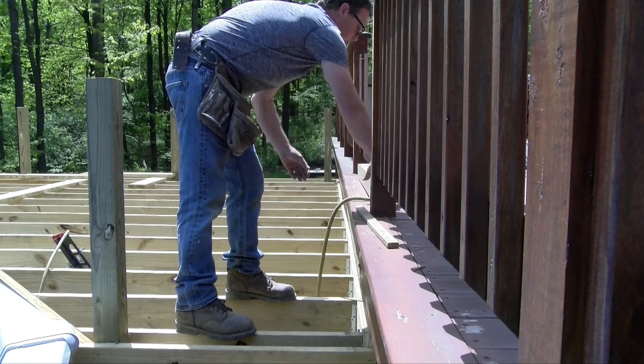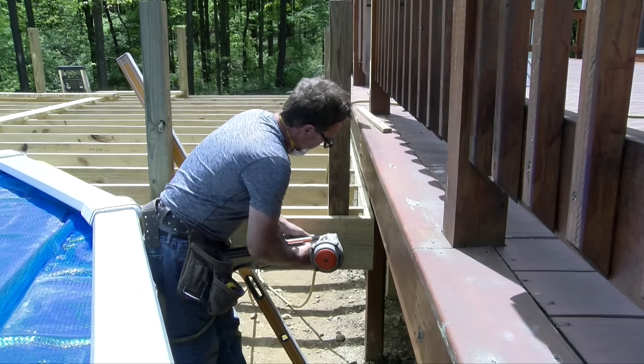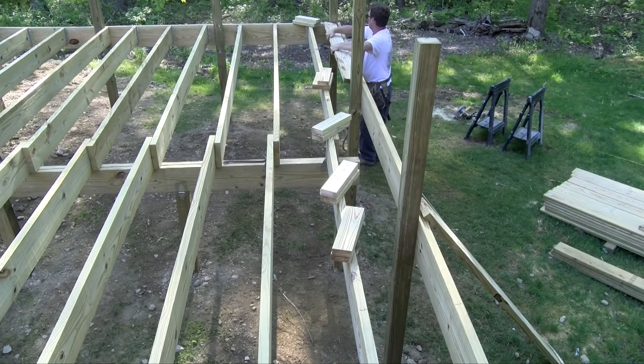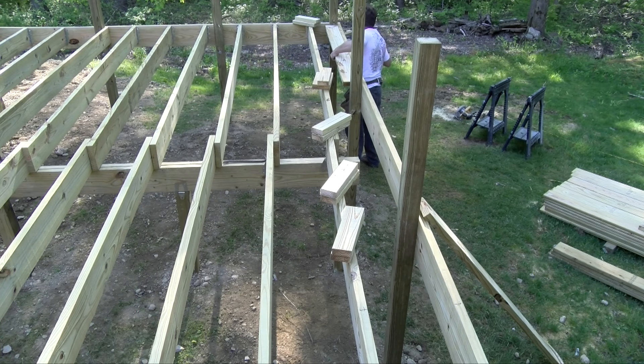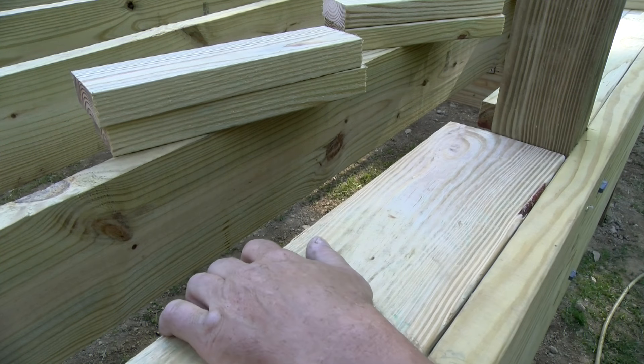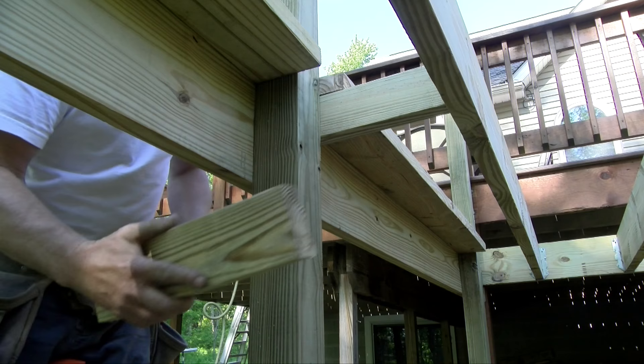I call this a dummy post because it goes to the bottom of the framing and not into a hole. It's marked at thirty-five and a half inches and temporarily held by a nail, then fastened with nails and two lag screws. These 2x6s are used as support for the decking border that we will install later; I put the 2x6s in between the posts and give them extra support with wooden blocks.